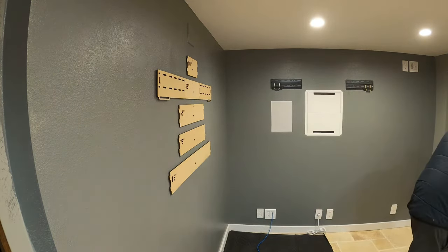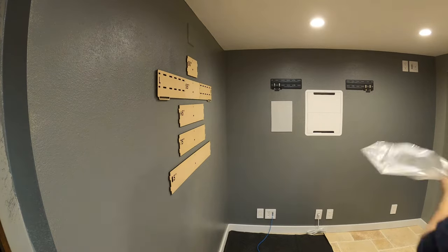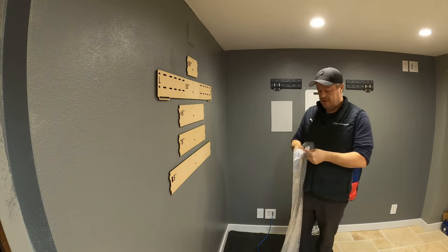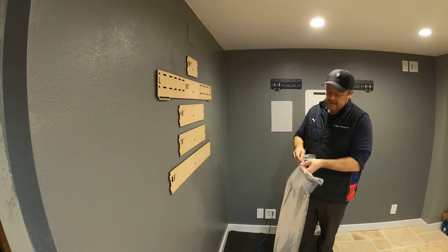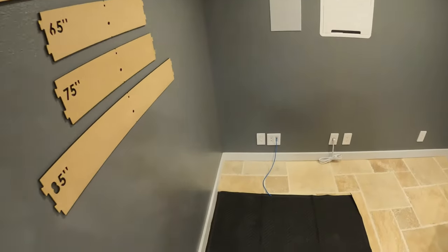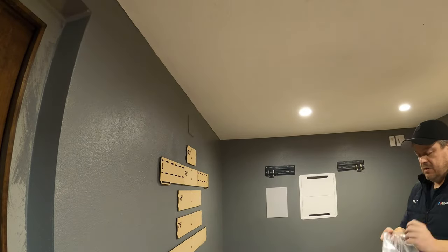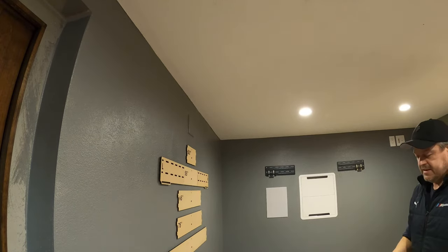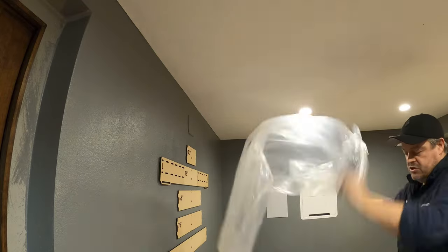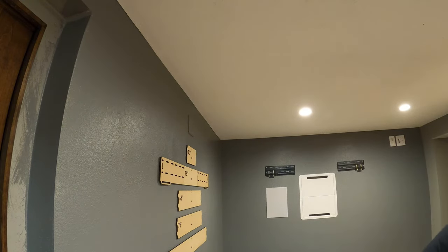Our second step — and we've got a video on this — is we like to use drum liners. I'll show you why we use a drum liner when cutting in a ceiling speaker or can light. I'm going to move this black drop cloth over, and you can see it's pretty clean with barely any dust on it. I'll tilt the camera up to the work area. You can actually cut one of these in above a grand piano and really eliminate most of the dust.